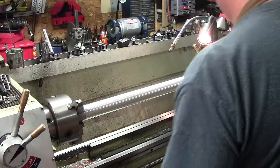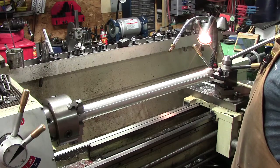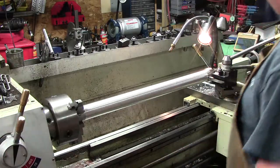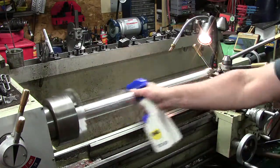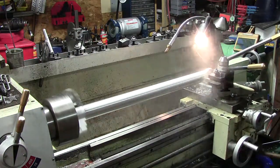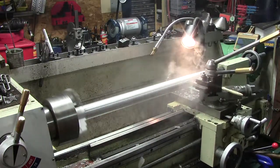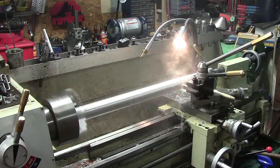Not bad. Okay, let's go ahead, let's dial in. Let's see, we had 10. Let's do 15 thou. So we were at 10, so we need to go 25 thou. And I think, yeah, we'll leave it. Well, let's go up to 2 grand. Let's see what she does at 2 grand. So about 2,000 RPM, 15 thou depth of cut. So 30 thou off the total diameter, which we're at 26, so it dove in a little bit. About 1.5 thou it pulled in, but that's fine.